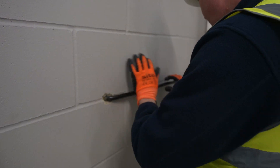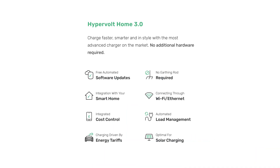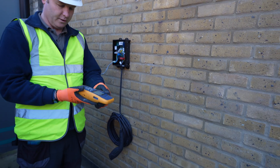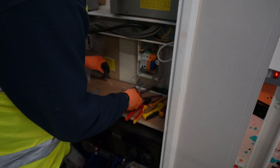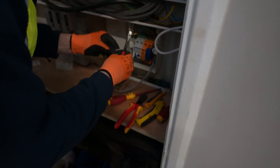On the topic of clever features, it includes internet connectivity — both wired through ethernet using the additional spare wires, or wireless through Wi-Fi. Stuart uses a professional Wi-Fi signal strength tester to assess the situation, and with fantastic signal reception even outside, we decide to go with the wireless setup. That will keep a wire from the bunch available for circuit load sensing, enabling dynamic load balancing if needed.